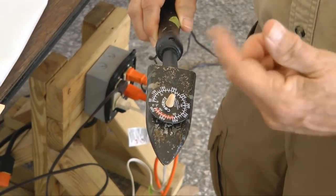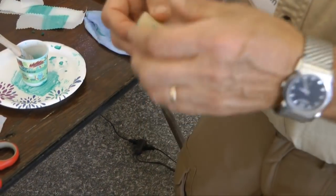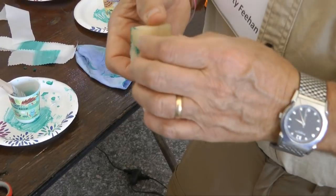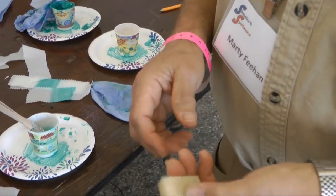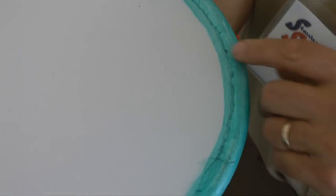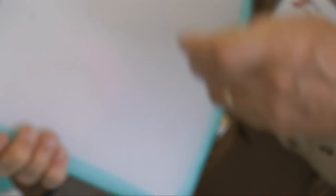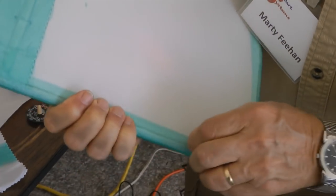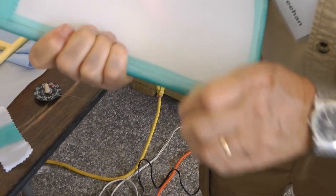Stuart sells these thermometers — it's real simple, similar to what's inside a thermostat on a wood stove — and they'll tell you what the temperature is. When you've got glue on something and need to get it off, whether it's on a table or on a tube, we use these gum eraser blocks used to clean off belt sanders. We cut these on a bandsaw into pieces, and any time you want to remove a glob — say you've got something thick that's going to leave a bump — you can take this and it'll help remove that gloppiness. It'll pull anything thick right off the surface.